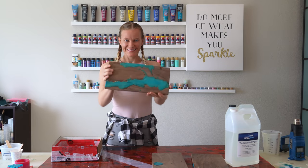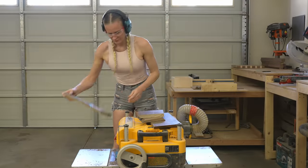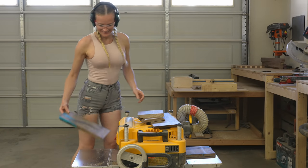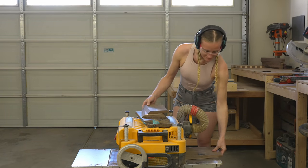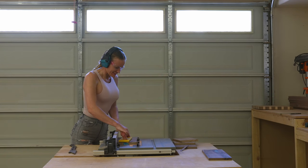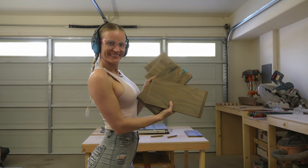It's the next day now, and the resin has fully dried. Let's take the wood back into the workshop. The next step is to use the planer to take off any excess resin. After the board is smooth, use your table saw to clean up the edges. Those pieces are all done.